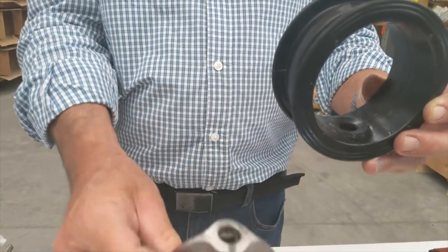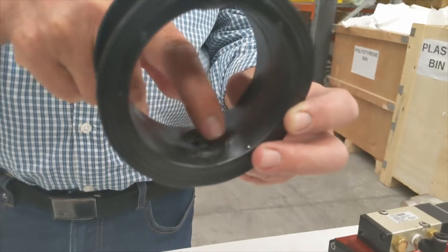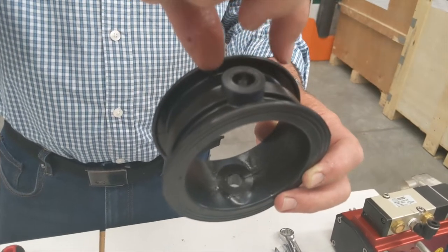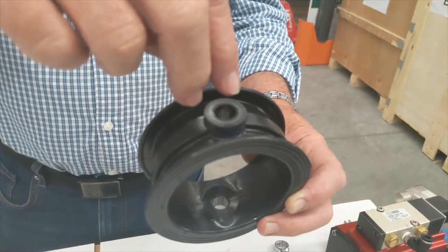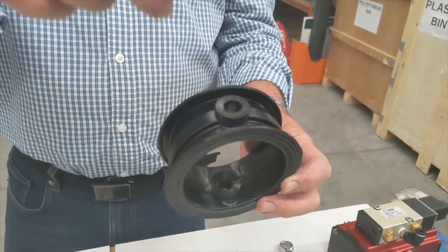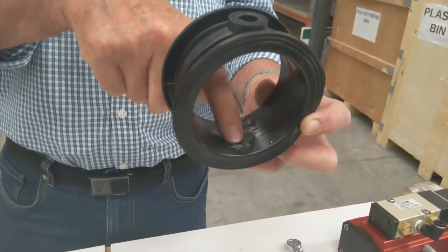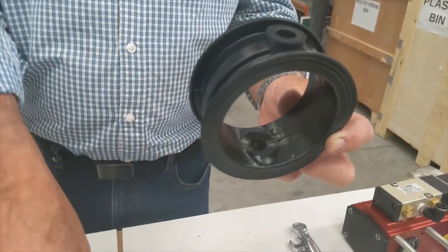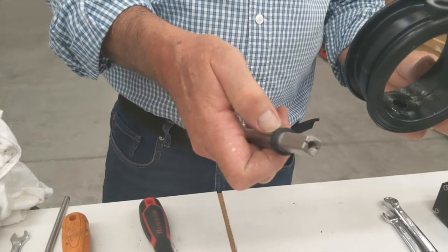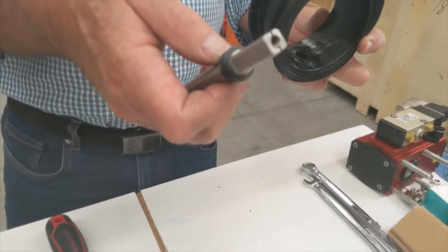It has the corresponding pad in the liner itself. The seal is perfect where the disc meets the liner — you have the compressor force which is contained by the body, so you've got a very high loading. You don't have a backup seal on the shaft; the seal is at that point there. There is an excluder on the top of the shaft, and that is to stop dirt and water getting into the valve body from outside.